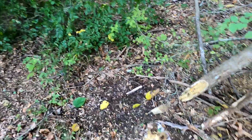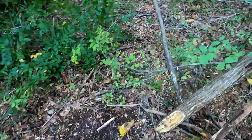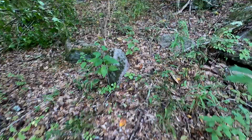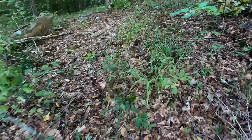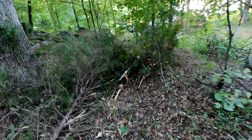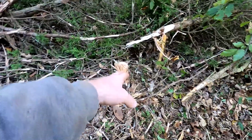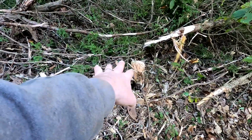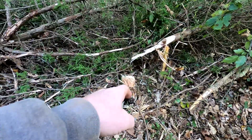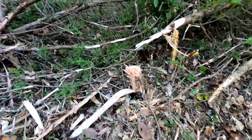But anyways, what I'm trying to say is with a carbide, you'll end up with a stringed stub. Let me see if I can find one. What happens is you end up with a stub more like this. When you run carbides, it'll tend to look like that unless you run over it. That was one little pass. I mean, I just barely zipped through it. But with carbides, you end up with that material stringing like this. It won't actually slice that.